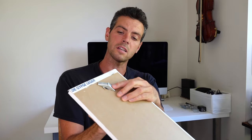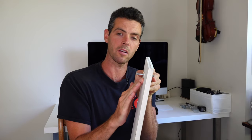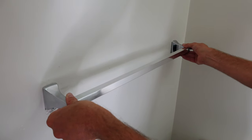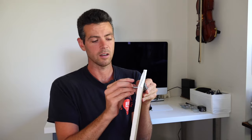I leave a couple millimeters of slack and then do the rest with a screwdriver to make sure I don't crush it. What might happen is you start to pull the anchoring plate so far into the wall that the escutcheon part won't go back over and hook on, and you won't be able to do that little threaded bit. So make sure it's not too tight.